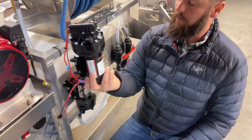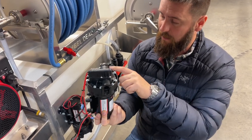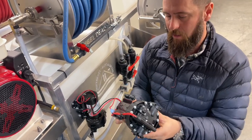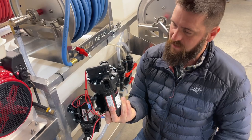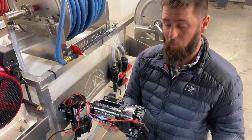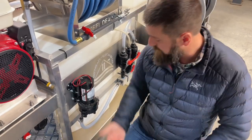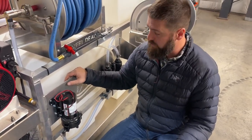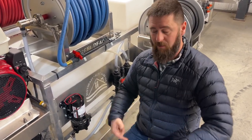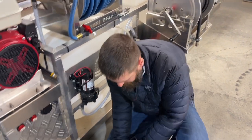Let me show you how we can confirm what the suspicion is — there's not much to check here. About the only couple of things that can go wrong with these pumps: they leak sometimes. Check these screws here — these are Torx; they use really nice stainless Torx screws — make sure these are tight all the way around and sealing this gap. If you get a leak, the only other thing is the pump can wear out and quit, or if it's doing nothing at all like this one, it's probably the pressure switch. I've had a pump that worked for a month or two, started acting weird — tap on the pressure switch with a screwdriver or pocket knife and sometimes you can get it to jog. That also tells you the pressure switch is starting to fail.